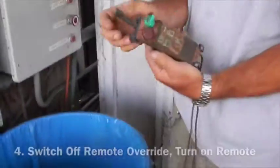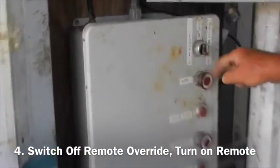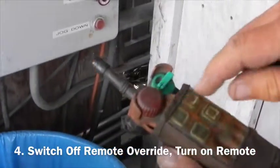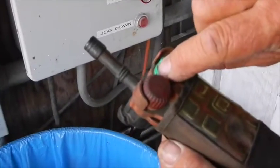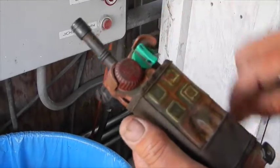This is the remote control unit. Set the contactor box to remote. Turn and release the emergency shut-off. Turn the green switch to the on position and then turn it over to the temporary position until you have a flashing green light. You're good to go.